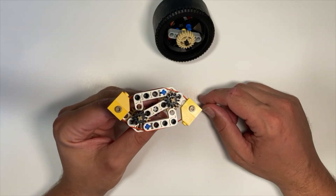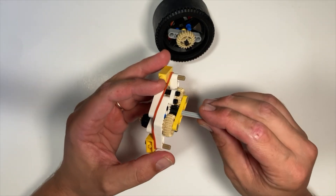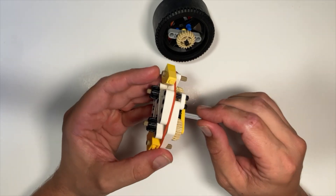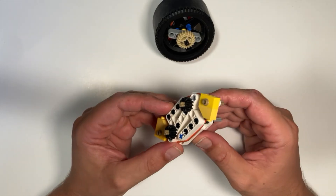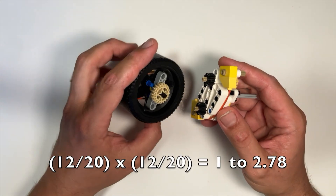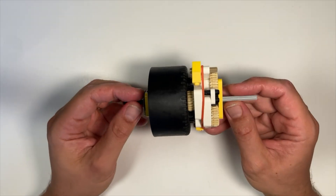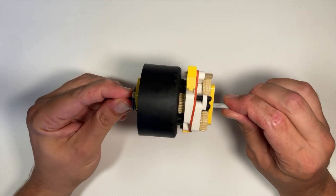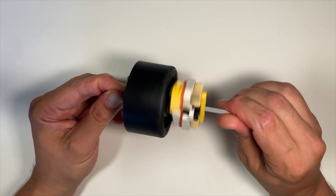To achieve the minimum gear ratio, the input shaft with the sun gear turns the relatively larger planetary gears. This gearing ratio is repeated on the other side, giving us a final gear ratio of almost one to three. In this minimum gear ratio, the ratchet mechanism is essential because if we have any resistance on the output shaft, the whole spindle will spin to relieve the strain by turning in the opposite direction.